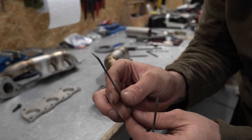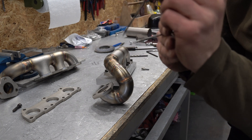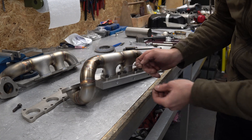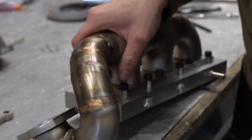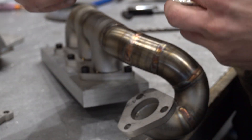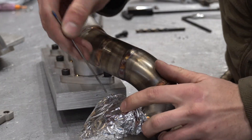I've got one bit of straight tungsten and one that I've bent. I'll stick it in the vice downwards, tap the pedal on it until it glows red, then bend it across — it's really good for getting into tight spaces, getting around the side of a runner. Always good to have one knocked up and ready to go. Honestly, don't sleep on the tinfoil — once that's done just plug a couple of holes to let the air pass through and get rid of the oxygen stuck inside.